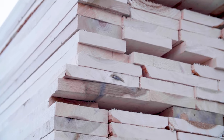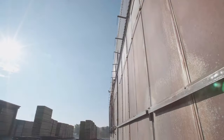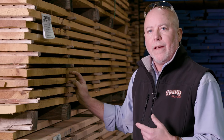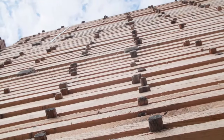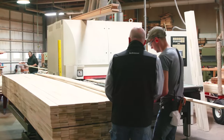Steve Stack here at Baird Brothers Fine Hardwoods. Today we're receiving some hardwood lumber, getting ready to process and manufacture high-quality dimensional lumber. We're in one of our rough lumber warehouses to discuss our drying process. The bunks of lumber behind me are on stickered lumber — the stick itself is a fluted material allowing air transfer so we can get it down to that six to eight percent moisture content level, ensuring it winds up in your projects as a true kiln-dried product: very stable, very straight, very flat.